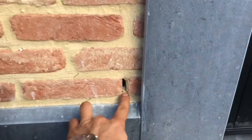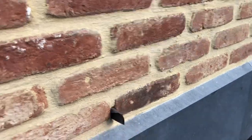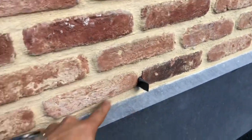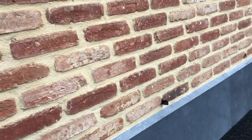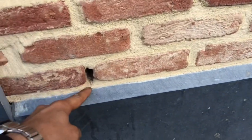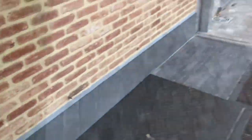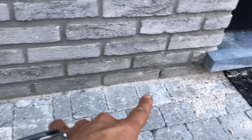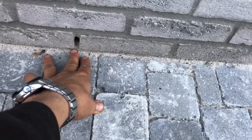So these holes here — look, there's still some plastic inside. Normally when the joints are ready, we pull them out. These holes are there so when it's raining a lot and your wall gets really wet, the water will run down on the backside of your brick, and if you don't have these holes, the water can't escape. Under this layer we have a plastic going up into the brick block wall. Here you also see the openings in the stutter joints — the vertical joints — so the water can escape to the outside.